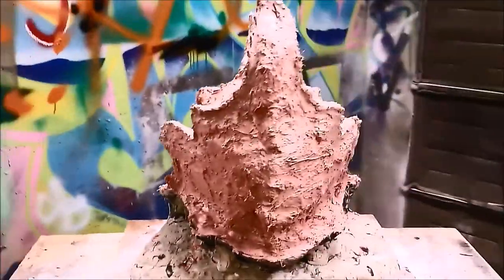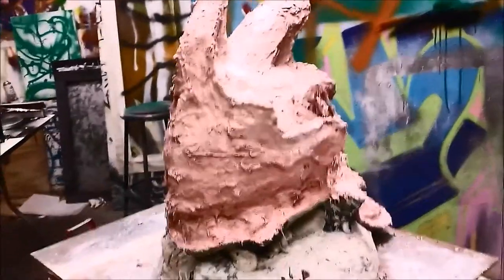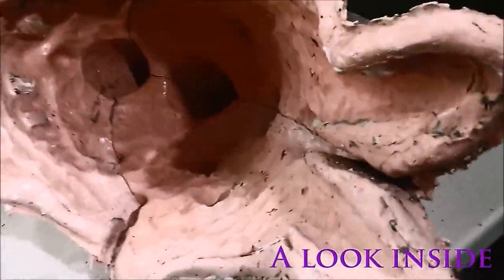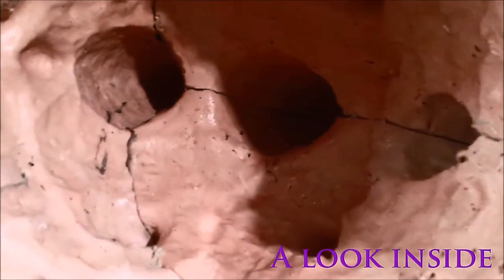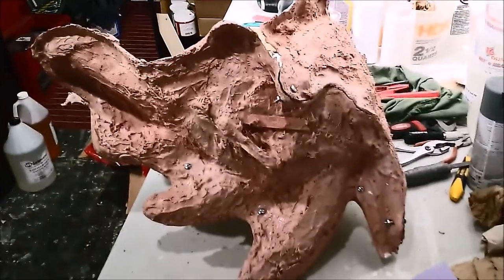Apply the first section, let it cure, and then remove the clay wall that is common to the next section. I'm making a three-part mold, so I have to leave a portion of the clay wall that is common to the second and third and first pieces. As a completely empty mother mold, you can clearly see the seams. The seams aren't randomly placed — they are strategically placed such that the mother mold parts don't grip more than 180 degrees.